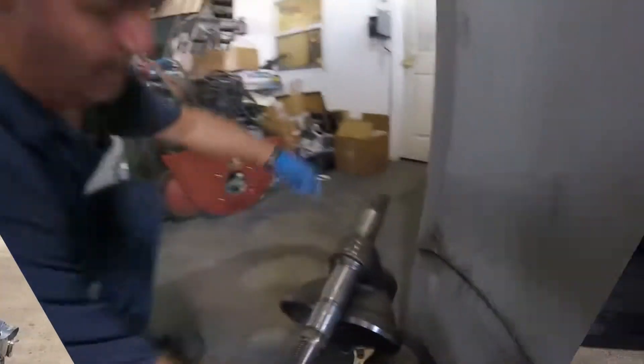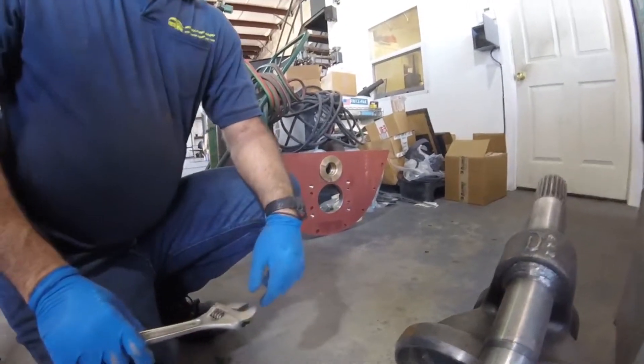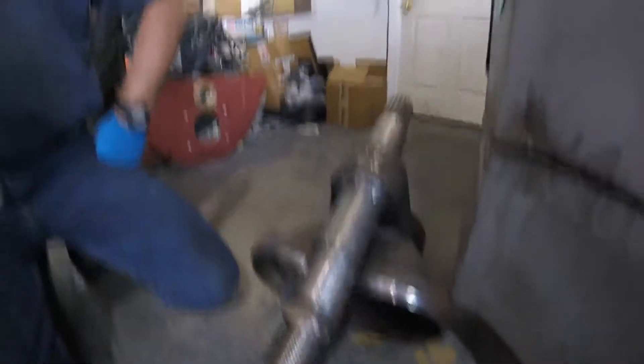Whereas a rock valve, you've got concrete coming out and it's hitting and then rolling into the hole, so there's a deflection there. When that thing spins over, it squeezes into the hole. Whereas an S-tube, it's a one-shot — whoop, right into the cylinder. So it's effective, but it's just an older design.